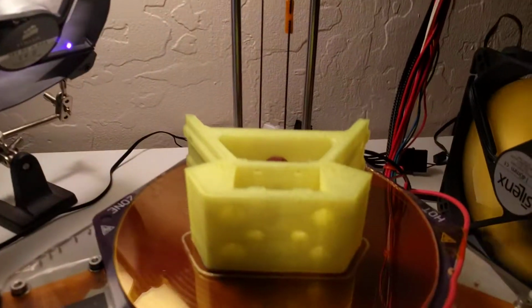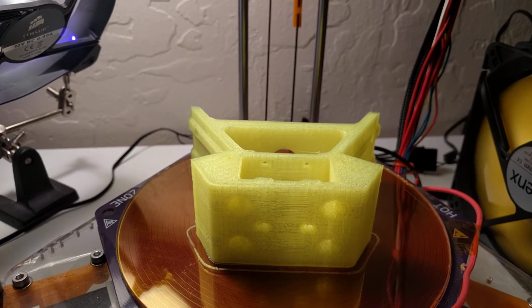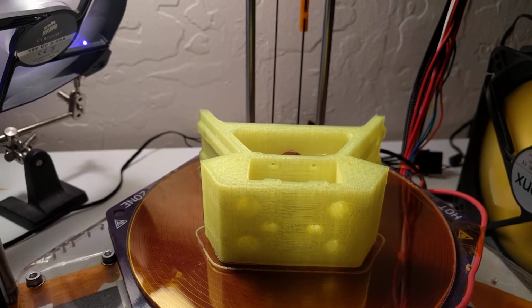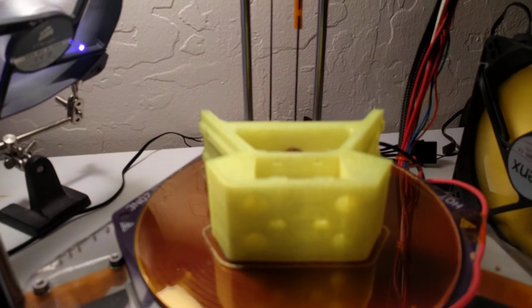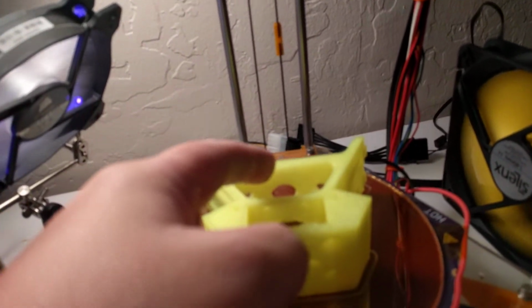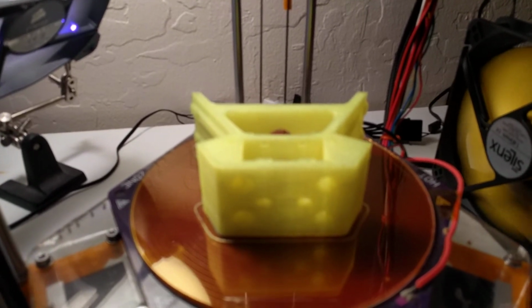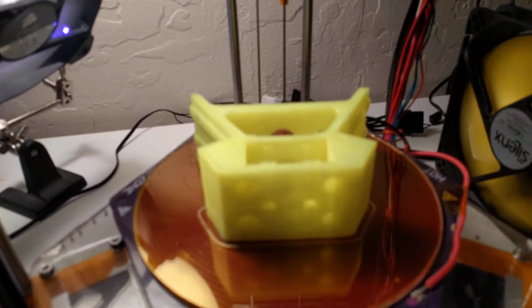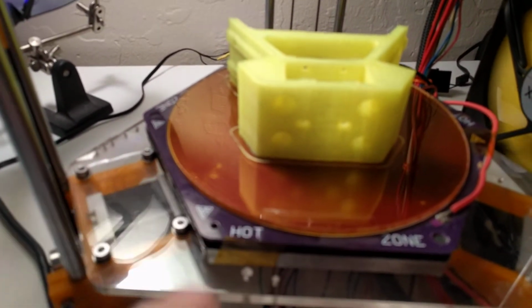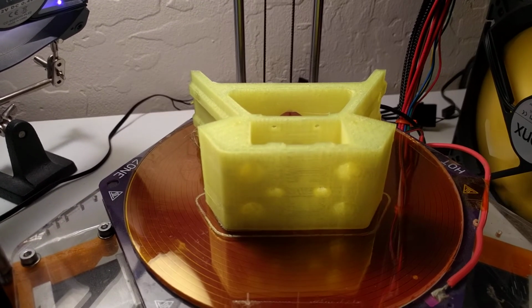So in a moment here, once the bed reaches 25 Celsius, the G-code should kick off automatically to kick the part off the board. It does a series of operations. First, it'll move the head into the empty spot here, and then kick it into the negative Y direction away from the Z tower, which should knock it off the front of the board here. And then it will run a couple of wipes across the plate to try to remove the skirt here as well. It usually comes off with the main part, but I just wanted to be sure.